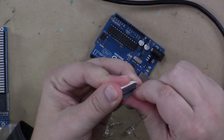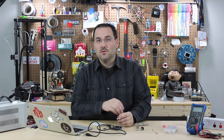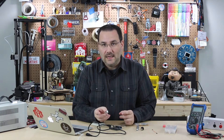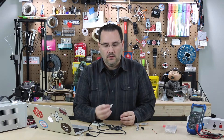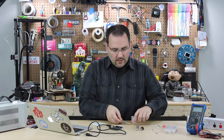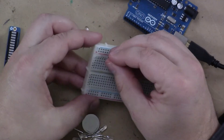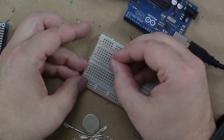They are quite affordable, a really nice small package, but I'm going to go old school and just wire up 10 LEDs and go from there. Keep in mind, this does not have built-in resistors, so you'll need them. In my version, I'm going to use the resistors on each LED individually — you also have to do that with this component. So let's get started. I have my 220 ohm resistors, all my LEDs, and a breadboard. I'm going to use the odd number rows for the positives.